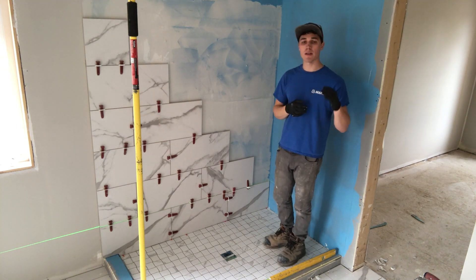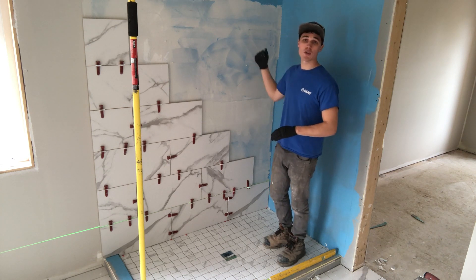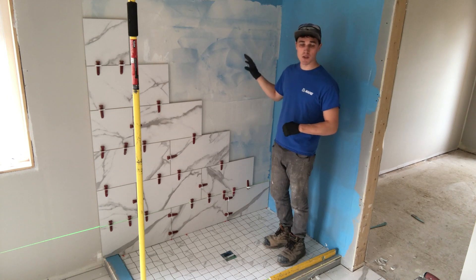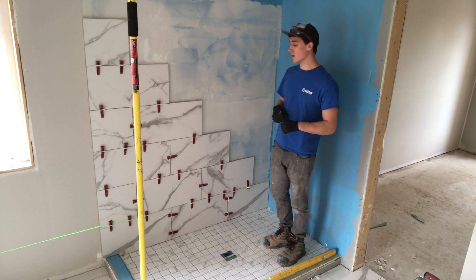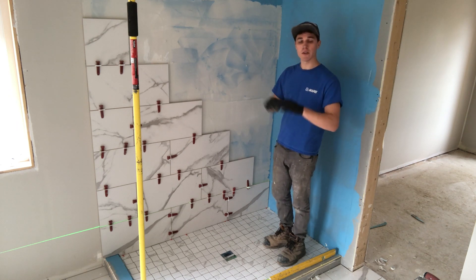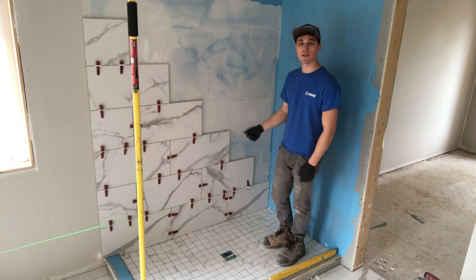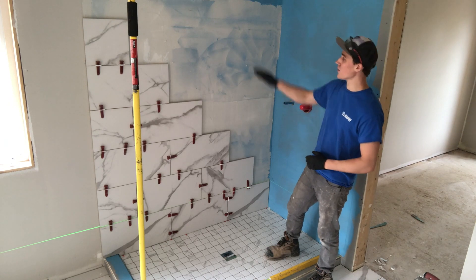What I'm doing is applying the cement directly to the back of the tile with the notches and flat troweling the wall. That ensures that you basically prep the surface of the wall. If there's any dust or debris laying on the wall, you're already taking care of it by skin coating it with some fresh cement. Then when you take your tile and stick it on the wall, it'll ensure that you've got that bond at the bottom. We're going to continue on now and I'm going to show you what it basically looks like to carry on from this point.